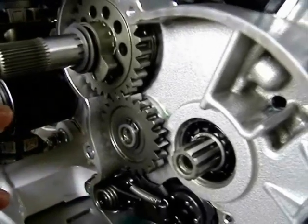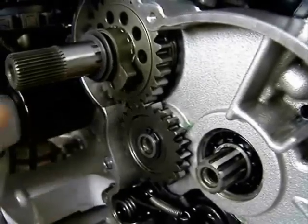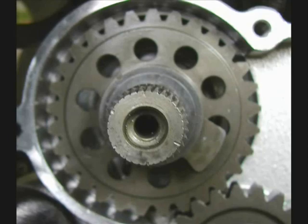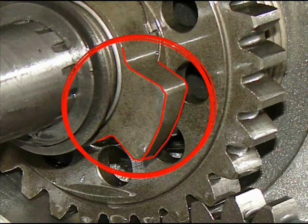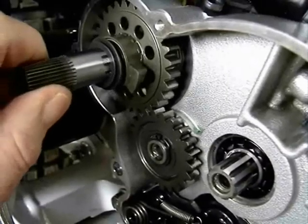There's a little thumb sticking out on this gear that rotates around and tucks behind a little ramp that's inside the clutch cover itself, which I will show later. This little tab sticking out of the gear, highlighted here, is important during reassembly, so I'm going to show in detail how that works so that you understand it.